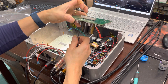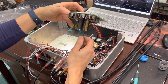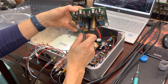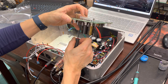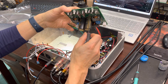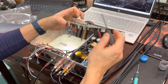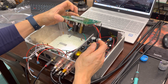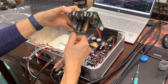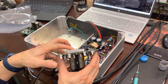Every now and then you want to look down at the gap and make sure that it's level. If it's not, you might want to tighten or loosen one side or the other until it is level. You want it just a little bit snug — barely finger tight. If you overtighten, it'll damage the chip. You just want to have a good thermal contact between that block and the chip itself. I'm looking down here and it looks like it's actually cocked a little bit, so I'm going to loosen this just a tad and then tighten the other one. The block should be parallel to the board.